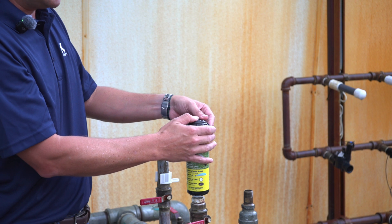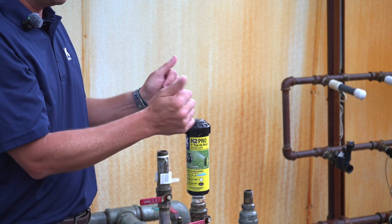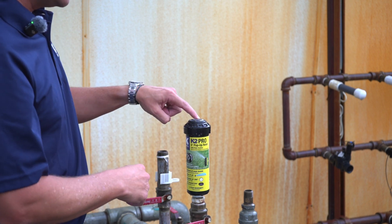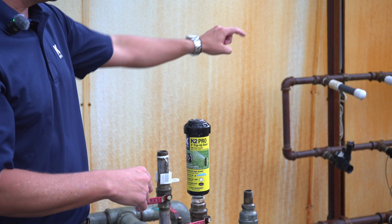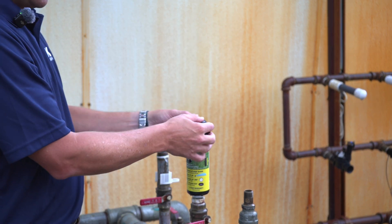The first thing we do: ratchet to the right until it clicks, then ratchet to the left until it clicks. I'm only moving the very top of the sprinkler with my two thumbs — that's all the pressure I need. Click back to the left, click. When it stops, the arrow on top of the sprinkler is pointing where it's going to start spraying.